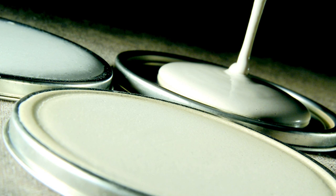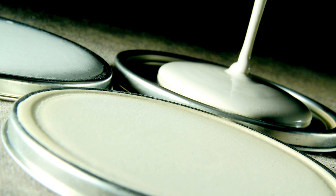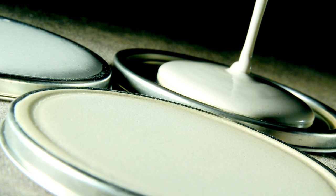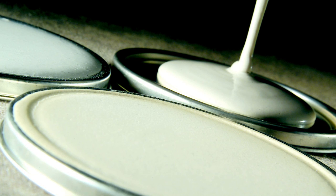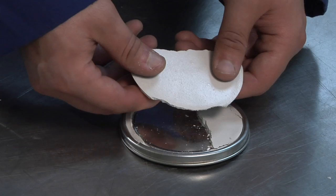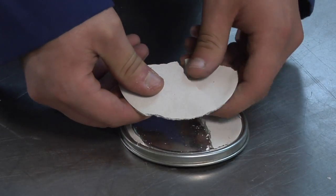Subjective methods of evaluating the finished product are to cast small discs and inspect for evidence of shrinkage, residue, or weakness. Material of sound physical condition will bond to the edges of molds, exhibit a smooth, hard surface, and produce a clean break when destructed.